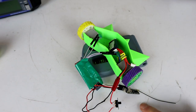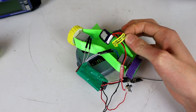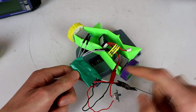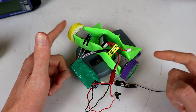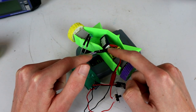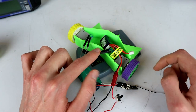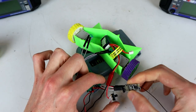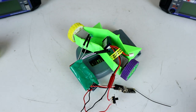Quickly though, let's look at the electronic stack I've got here, just so you can see what's inside the robot and what we're dealing with. We have a typical 2S 180 milliamp-hour LiPo battery. I have an ESC which is actually a homemade one — a little bit dodgy, but it's just a stand-in for any ESC that will drive two N20 gear motors, which is what these are. I have these hooked up with bullet connectors or pin connectors so I can swap them easily to change motor direction. And then we have a receiver and a switch.